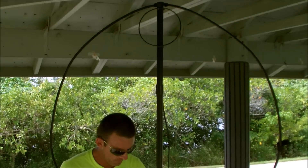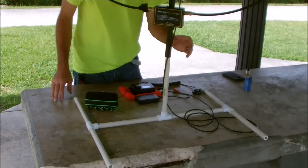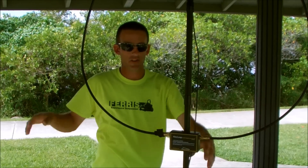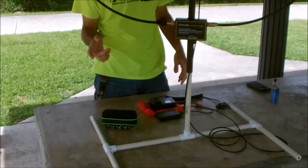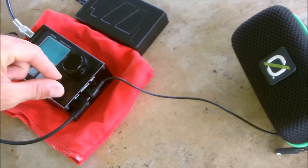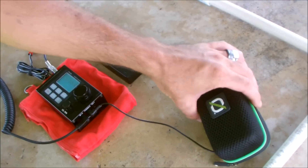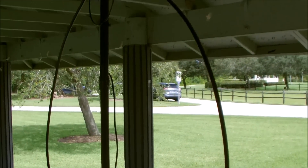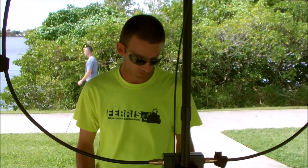I've got the Alex Loop set up on a little tripod. It does have some directionality — looking at the flat end would be a null, but facing it the other way gives more directivity. I have it connected to Jan's LNR Precision QRP rig, the FX4 Alpha — a 5-watt solid-state software-defined radio that does four bands. He's got a little battery backup, a speaker, and a hand mic. The antenna is rated to 20 watts but I'm using it at 5. The bands are up and down today, but let's see what I can do with 5 watts on this loop.